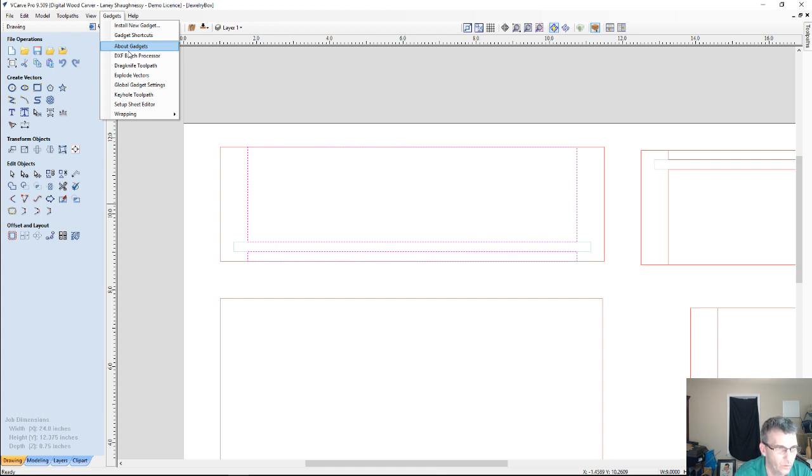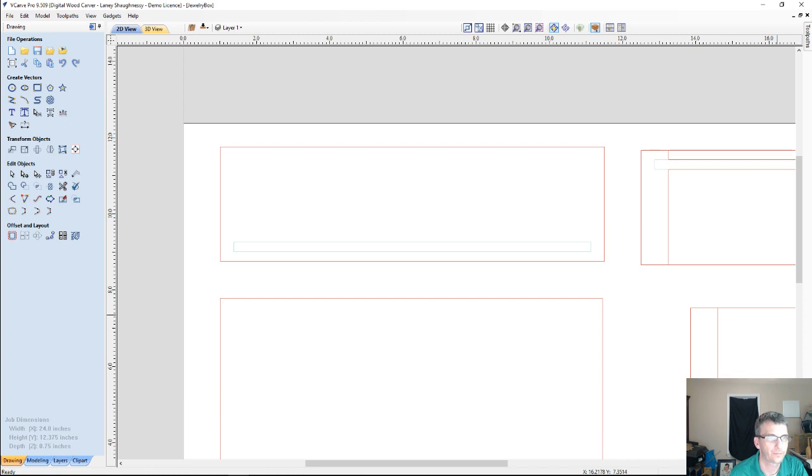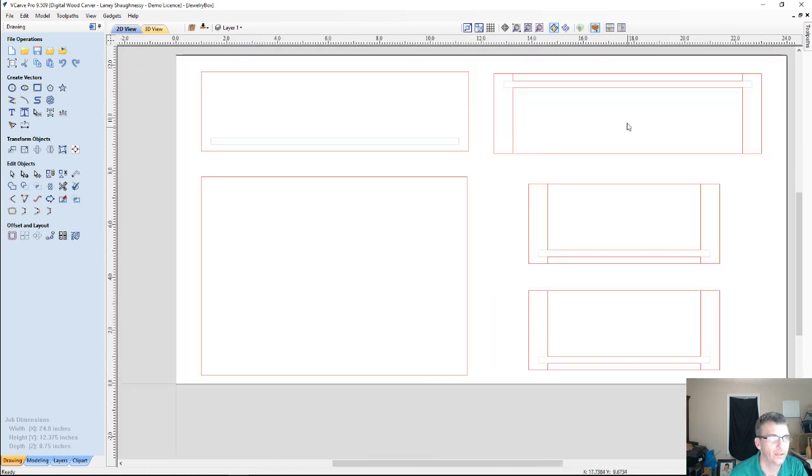We'll talk about chamfering, or doing that type of setup using the chamfering gadget, in another class. But I don't want to confuse the issue by showing you how to cut these miters on the ends of the boards, because it can easily be done with a chop saw or a table saw. So if I were going to use the chamfer gadget, I would recreate these two lines on each end and create a rectangle boundary where my chamfer would be on these ends. The middle parts would be gone, but let's go ahead and get rid of them so that we don't cause confusion.